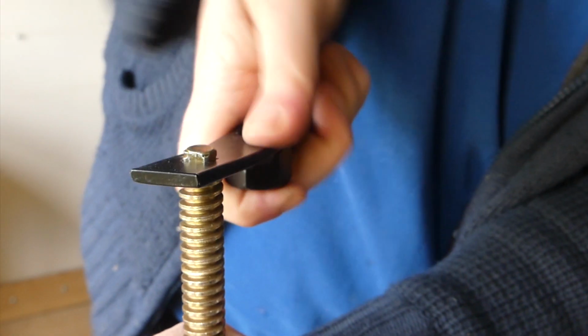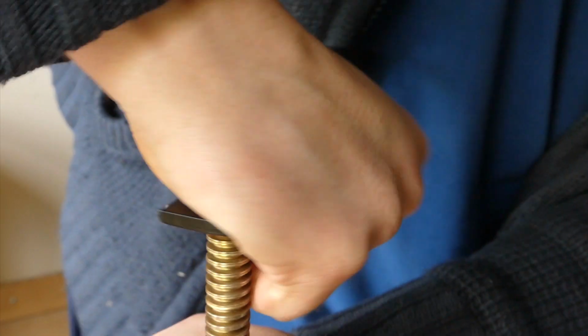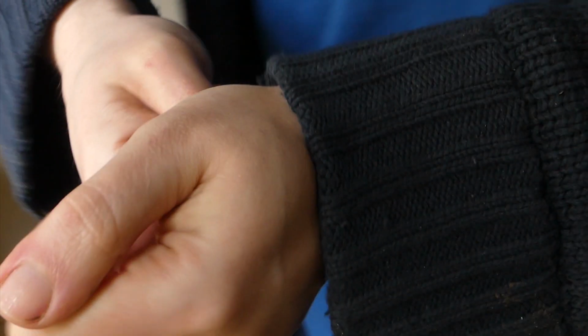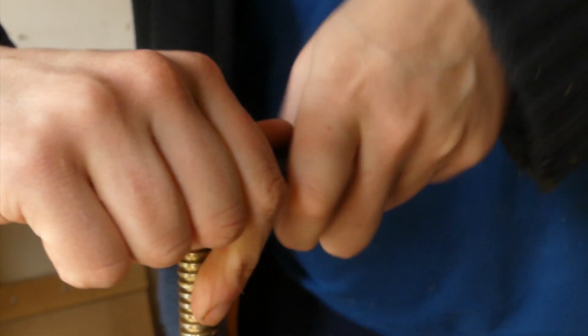And you can just use this to help you get it in there. Another thing that people say about these screws with the wide threads on them is some are made for being screwed into cross grain, and others are suitable for end grain. Because this one has quite wide and thick threads, I think it can be used on end grain, which is what I'm using it on.